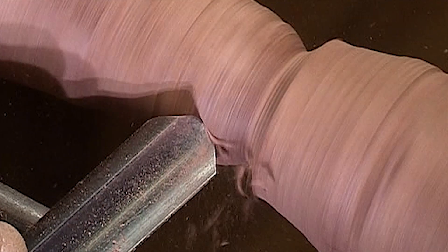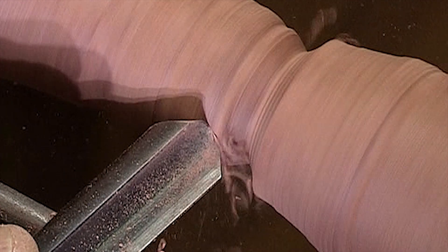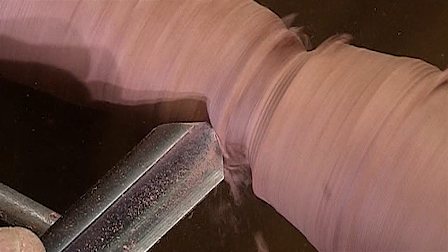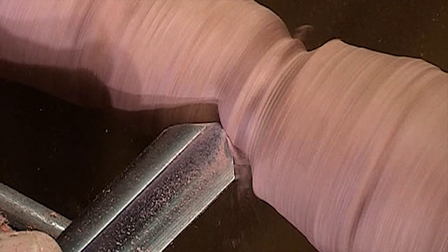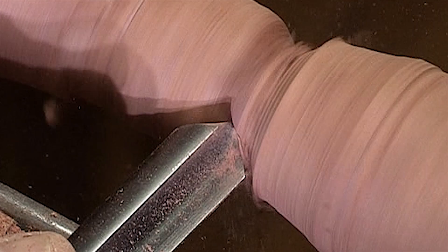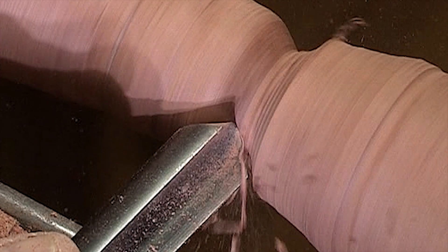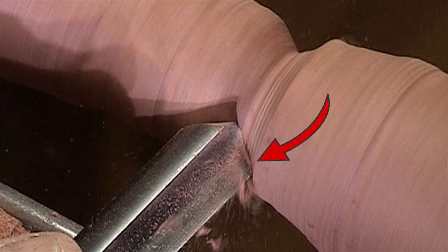Here it is closer up — you can see my mistake even better. But here's a proper cut making a bead. So roll the tool, roll the tool. You can see the tool is almost perpendicular at this point, but I still have that little bitty wing on the right hanging out. Now, if I'd rolled it just a smidge more, it wouldn't touch and I'd have a nice clean intersection. That's where it touches — that's the bad part. If I'd rolled it just a tick more, it would have been a beautiful cut.